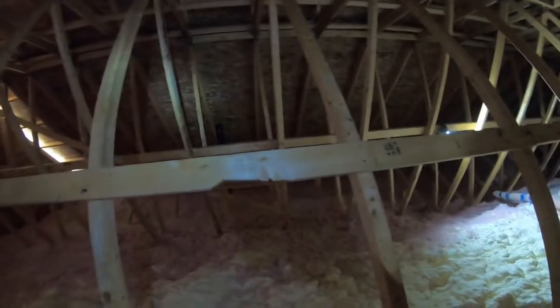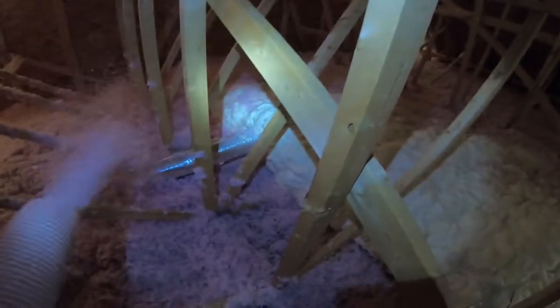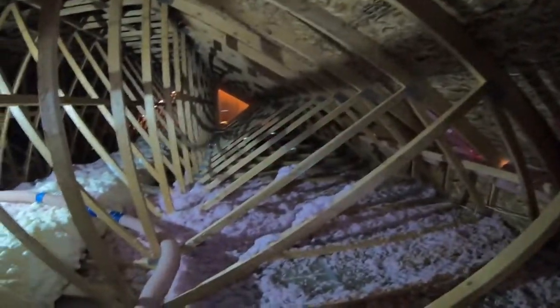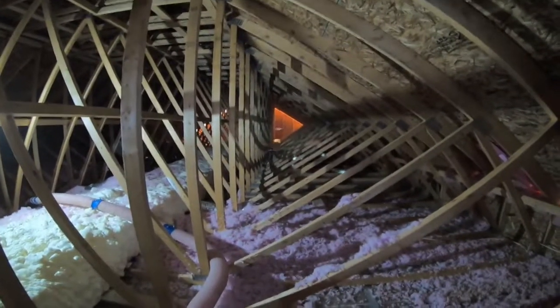I'm on the other side — the completed side. I was able to grab onto a 2x4 and walk across to the next 2x4, so I could get on top without damaging the half-pound insulation. I'm going to work as much as I can on this side, then work over there, and then come back over the heat run again and work to the other edge of the house.